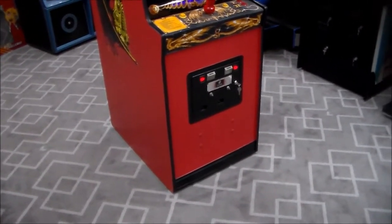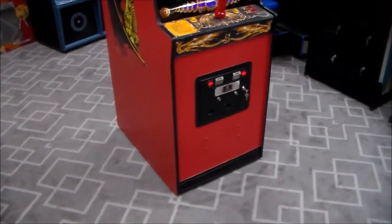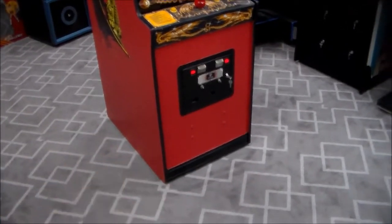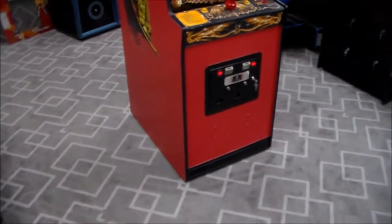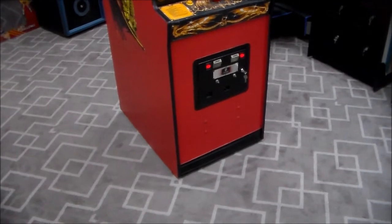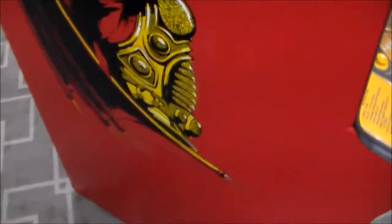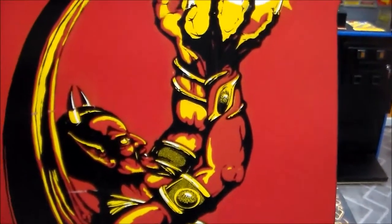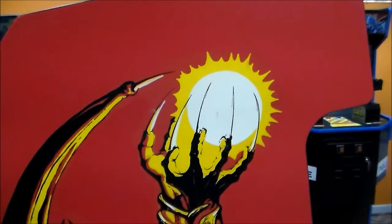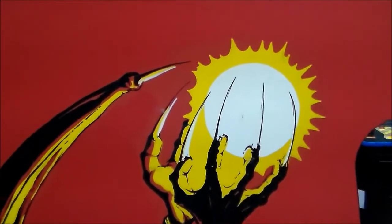So we had a lot of cabinet work that we did on it, so we replaced that board with a new sheet of plywood that's the right size and everything. And then the bottom of the cabinet on the edges was a little rough where it was attached to that board. So we put a lot of wood filler and Bondo and got that nice and smooth, sanded it down. And then fortunately we were able to match the color nearly perfectly. I don't know if you can tell. I can see it a little bit standing here looking at it. I can barely tell what was painted and what wasn't, but you might not be able to tell on the camera. I'll zoom in a little bit so maybe you can see it a little better.